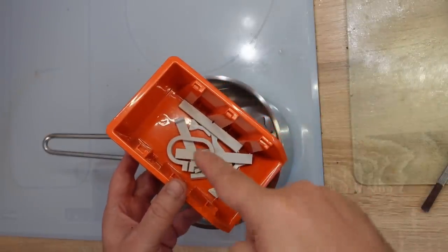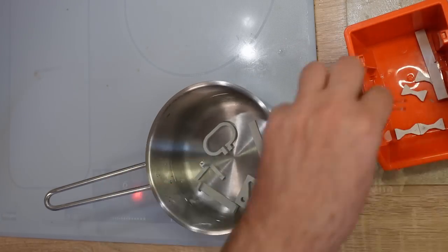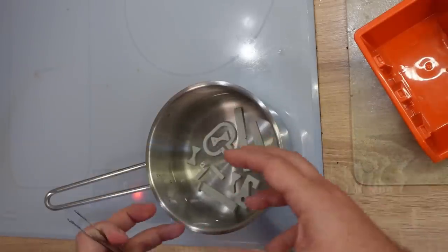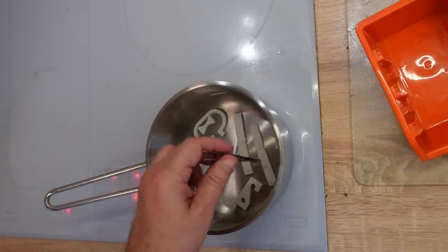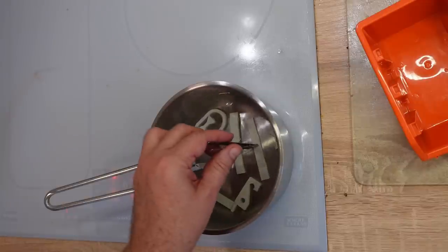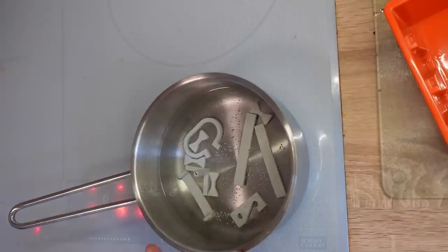Maybe a better method is to place them one by one in cold water and then slowly start heating. I will stop the heating now because I want to do it correctly. So I will start with the boiling of the objects I wanted to use as reference material and reprint new reference objects in the meantime. Now they are inserted correctly - the critical moment is when you insert them, as they will be soft for a few minutes. I can still see some deformation, including bending on the creep test object. I will finish as it is and see at the end.